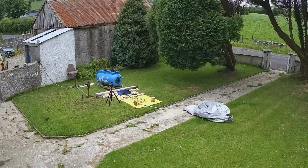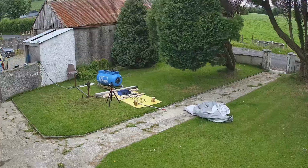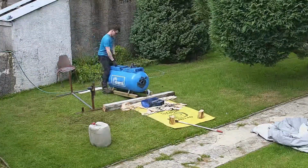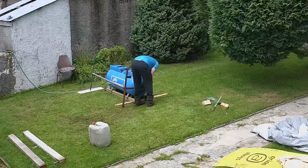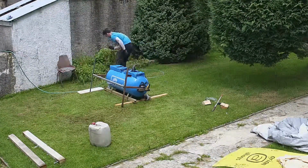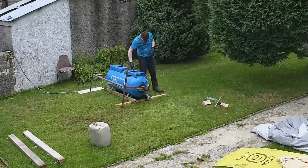Before the tumbler was mounted to the vessel to perform a pre-wash, 1 gallon of kerosene was poured into the vessel through the 2-inch port. The tumbler was then run for 1 hour and removed again. The vessel was then drained to remove all the liquid and the leftover fragments of media. The same process was completed to do 1 final wash.